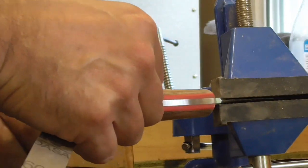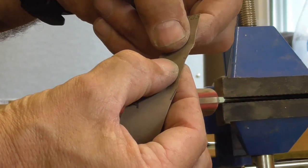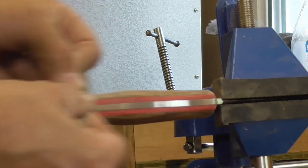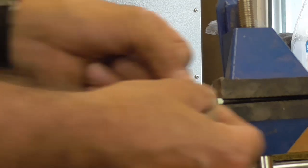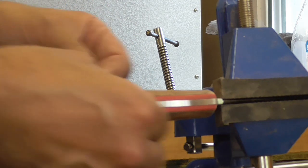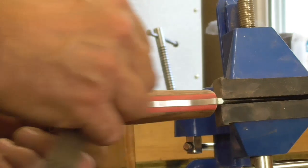Yeah, and then the idea is you rub, and you keep rubbing, and I'm watching the dust that's developed. As soon as I think, oh, I'm not making any more dust, I just slide my fingers down that paper to a fresh piece and carry on. Sometimes, depending on the type of wood and whether it's stabilised or not, or the size of your pins, you might be rubbing for 10 or 15 of these, 20 maybe at the most, and then off you go. Keep getting that dust off, or else all you're doing is moving the dust around and clogging the fresh part up. Not very pleasant.